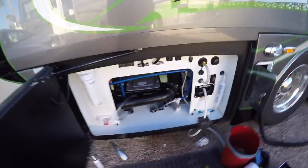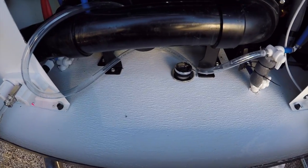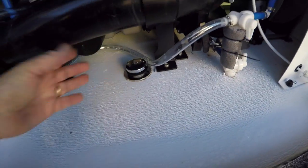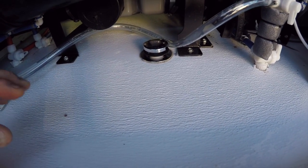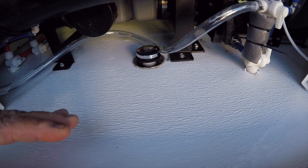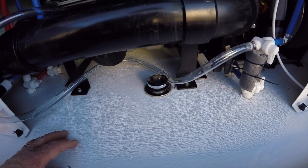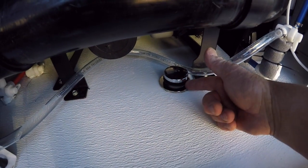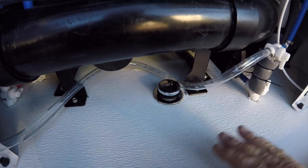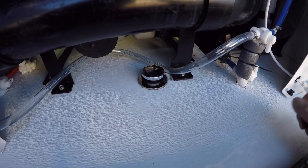The other thing worth noting actually is that this vent here, it's a bit stupid. I mean, it's very nice the fact that you push it, but it's higher than the level. So basically you need about 1/8 of an inch of water for it to go down. You get left with lots of residual water. It's a bit like having the bath plug raised. The bath would never empty. So that is a bit of a design fault. That really should be sunk into the floor, so it's at least level, if not countersunk. But it's probably an oversight.